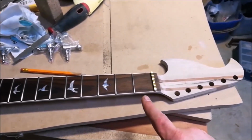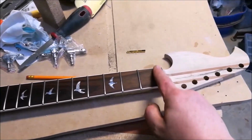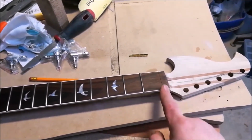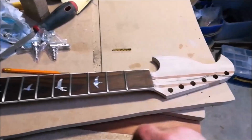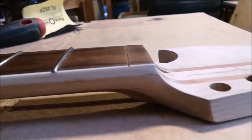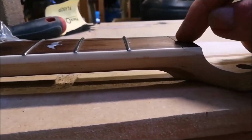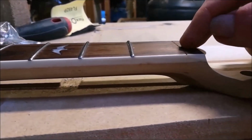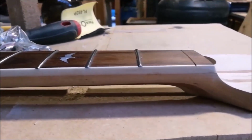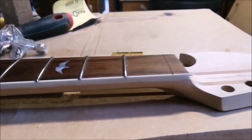So this is sort of half of each. It's got the flat style headstock and the nut that sits in the fretboard before the fretboard has ended, but it also has binding, which means that I'm having to cut the nut slot into the binding as I cut it into the fretboard, which really is no trouble. It's just different. It's something I have to do. So let's be careful about it.